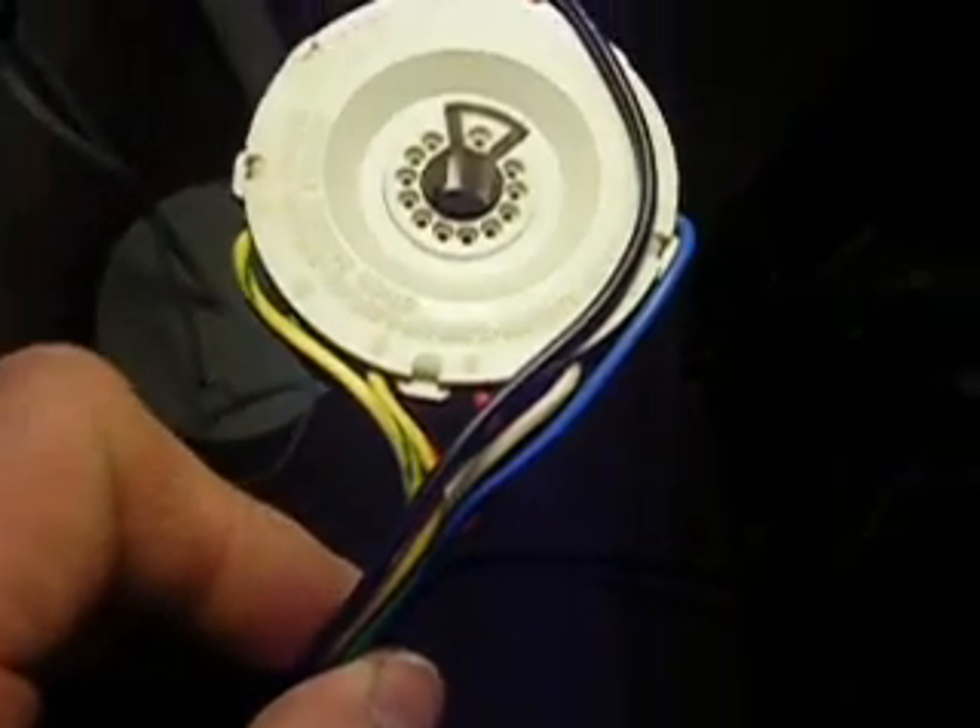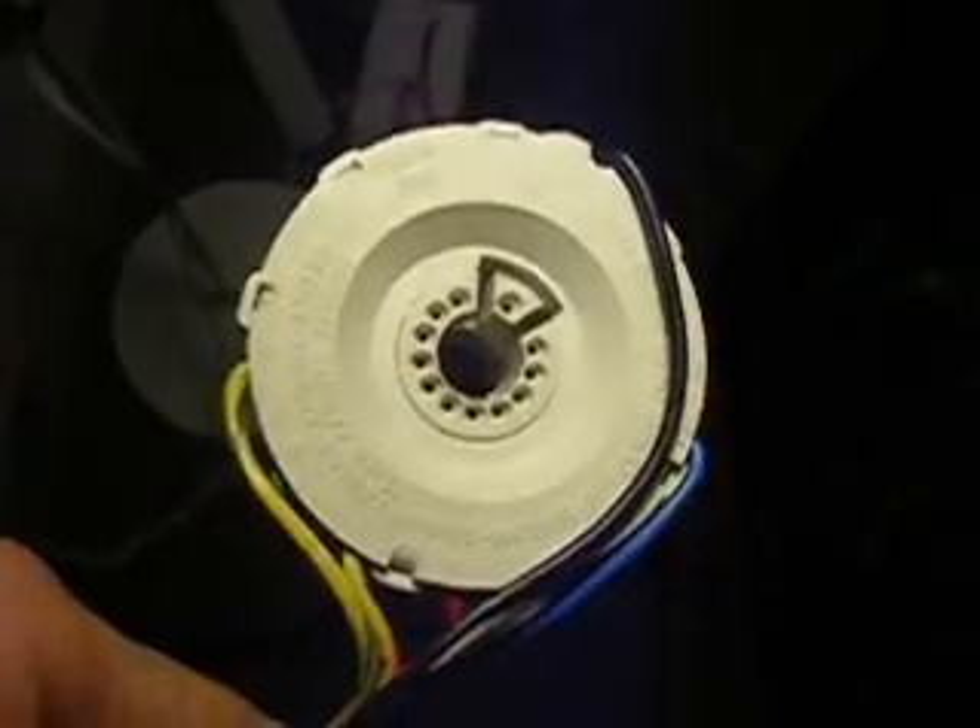Let's do one more discharging of the tube and get the process going. Got the clip hooked to the chassis — the monitor. We're going to discharge it one last time to make sure the charge is out of it. I've already got it up under the anode cap. I'm pressing and trying to hit the clip. I'm touching the clip — you can actually hear. I'm not getting any noise, no pops. I'm not going to press it too hard to pop it loose because I don't feel like reattaching it. That should discharge it.